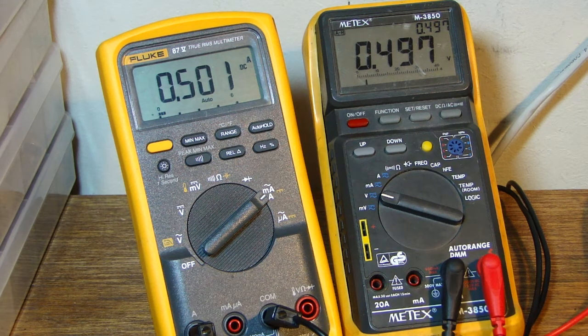Currently it's coming off a 5 amp, 5 volt power supply, so it's got more than enough guts to do it. I don't really want to toast my breadboard and my 10 resistors at the moment — which is the reason why I'm a bit careful with the Fluke's milliamp input, because as you can see I'm already above 400 milliamps. Which if I wanted, I could get it all up to an amp. So it's very accurate — I'm pretty pleased with it. 2 to 3 milliamps per indent is quite handy.